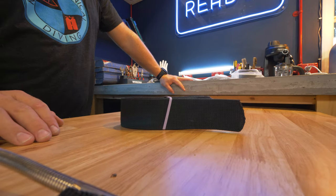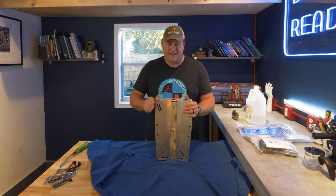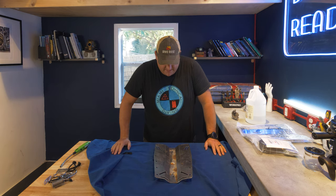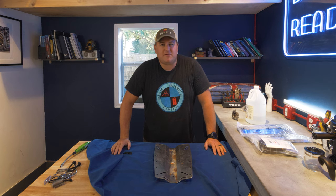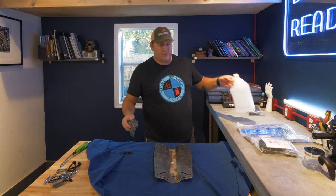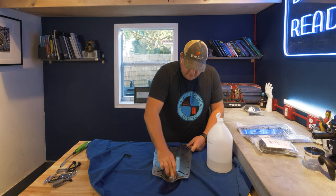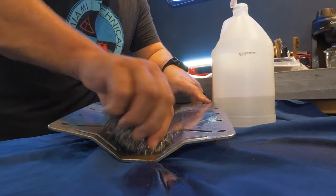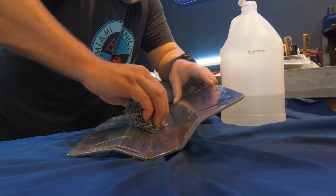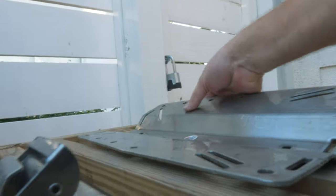Good to go — let's clean up that backplate. This old backplate is in a bit of a state, as you can see — it's got patches of rust all over it and it's filthy dirty, so let's give it a little bit of TLC. Now you can buy all kinds of chemicals to eat rust — there's Mr. Rust Cutter's must for rust and all that stuff — but none of those chemicals are particularly good for the marine environment. I've always found that just a little bit of a metal scouring pad with some white distilled vinegar and a little bit of elbow grease will get rid of the rust spots and give you a nice shiny stainless steel backplate, without flushing a load of toxic chemicals away. I put a towel down so any excess vinegar doesn't spend the rest of its life stinking out the dive locker. Instantly looking better — then all we need to do is give it a nice fresh water soak, get the vinegar off, and leave it to air dry.